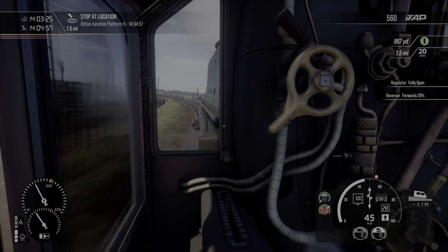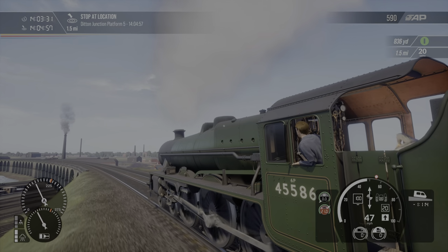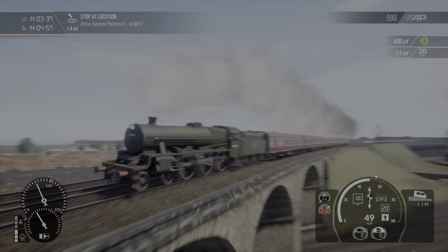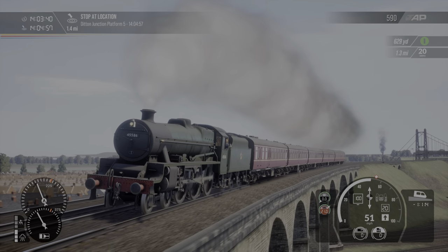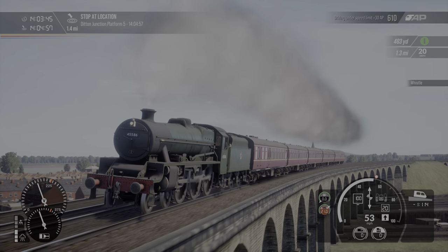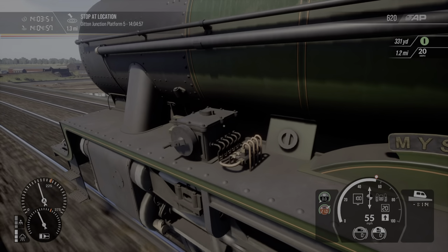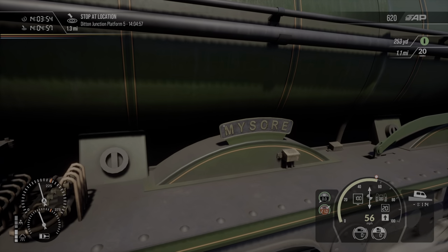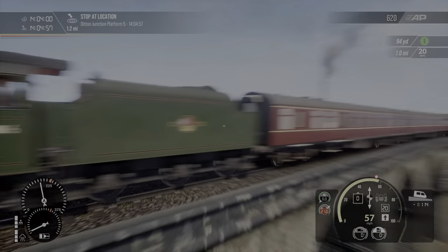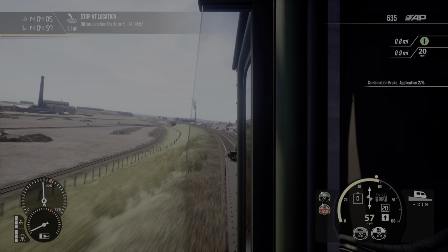Fully open and drop down to 20 or 25, up to you. And then you're using the loco more efficiently, using less steam, in fact. Using less steam now, and you can hit a greater speed. It's actually quite handy that we're going off on this. If you are curious what these are, these are mechanical lubricators, and these are all quite at max speed. We're only a short train, so that's why we've got them quite quick.